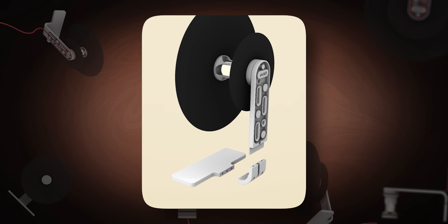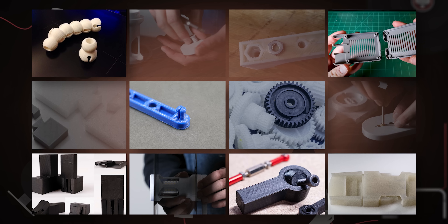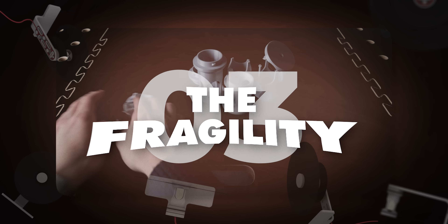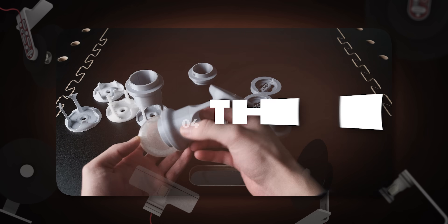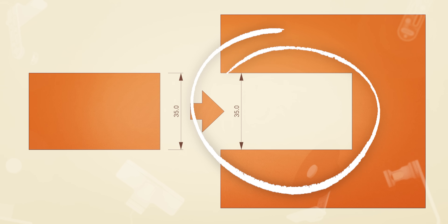After dividing the whole piece, here's our second pitfall: we somehow need to build it back, and that's tricky because some joints are hard to model and others take longer to connect. Next one is fragility — this is the weakness of a printed object caused by the layering process.